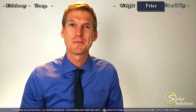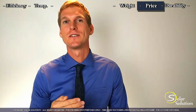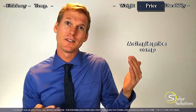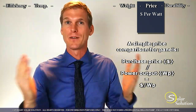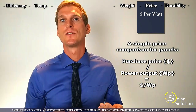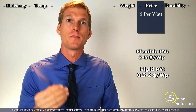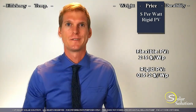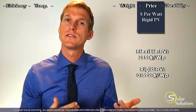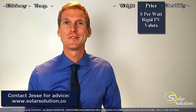The next topic: the price of flexible solar panels. How do you get the best deal? The conventional way of comparing solar panels on a price basis is taking the price you'll pay divided by the rated power output of the panel, and in this way compare panels among each other. In my experience, most flexible solar panels come in the range of two to five dollars per watt peak. And if you compare it to rigid solar panels, rigids are between 50 cents and two dollars per watt peak. Whenever I'm referring to prices, I'm always using US dollar values — you'll just have to convert to your own currency.